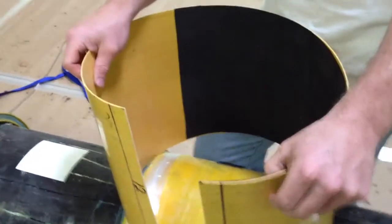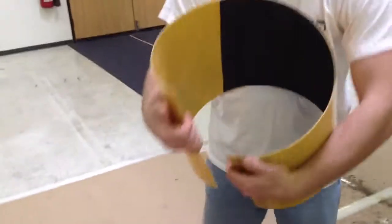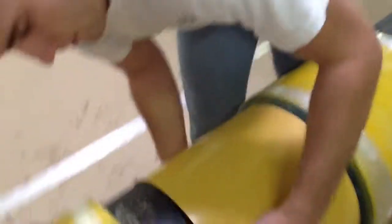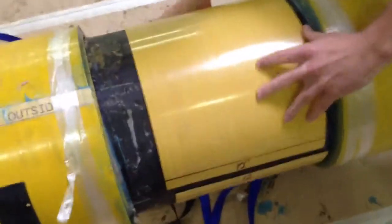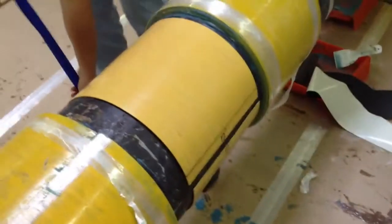This single wrap mold is essentially a one wrap clock spring coil. Corey is going to put this on the line and we're just going to ratchet it down — it's a very easy installation. The key is making sure that the black material, or the underwater starter pad, covers your leak well, and you want it to be at least 90 degrees from your defect area. We are exactly 90 degrees right now.